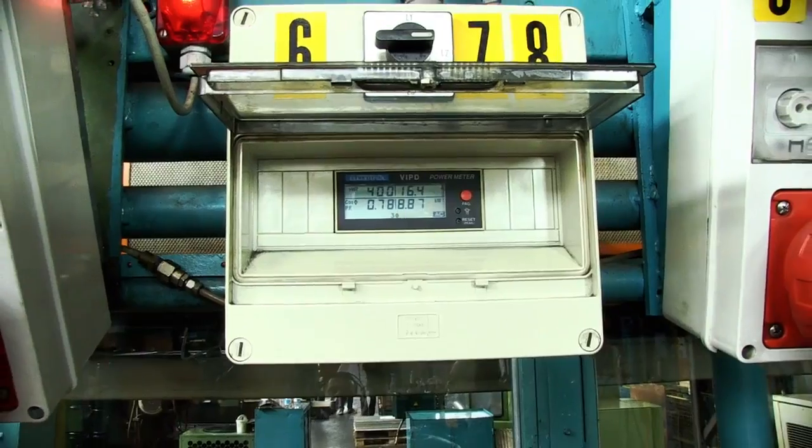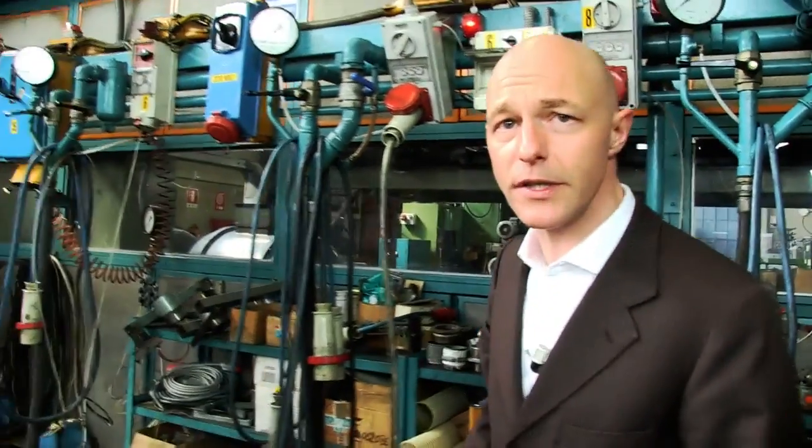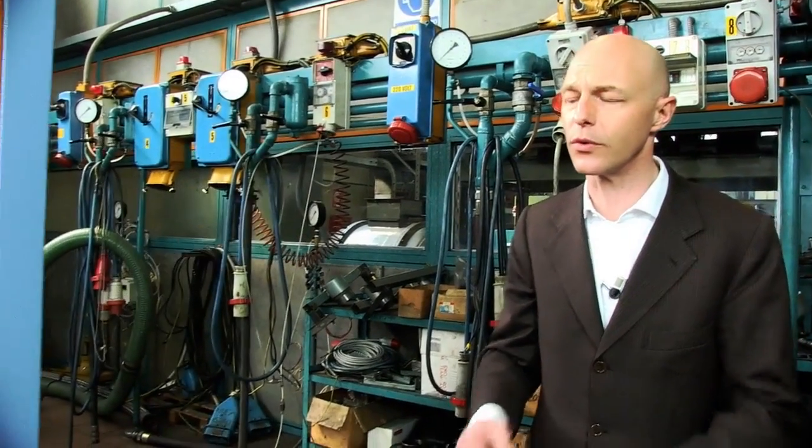The unit is completely air cooled, and it can also be air cooled in tropical countries. We can have a setup for up to 55 degrees Celsius environmental temperature and still keep the air cooling instead of water cooling.